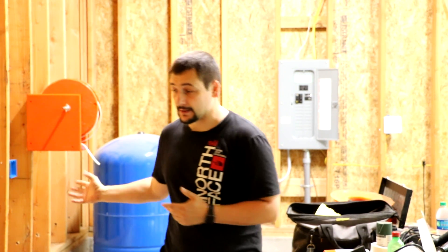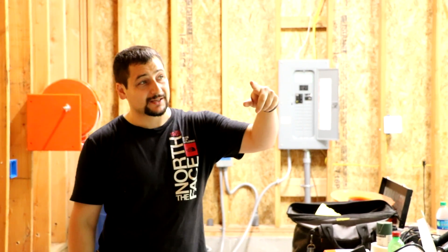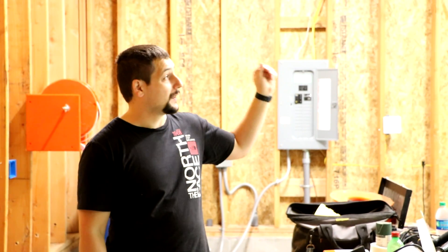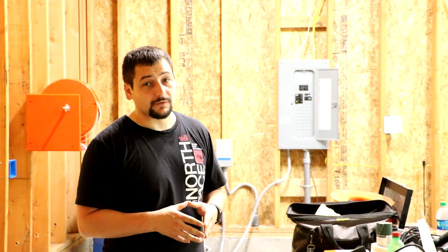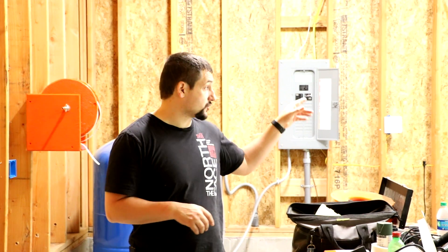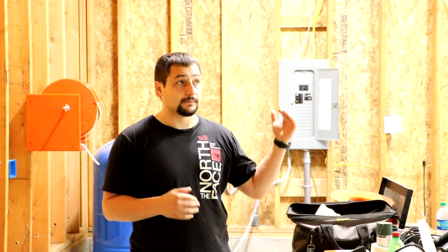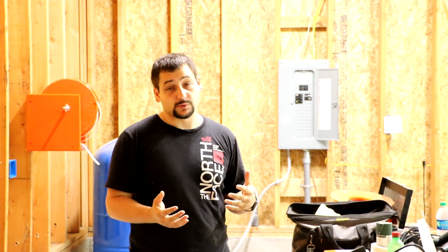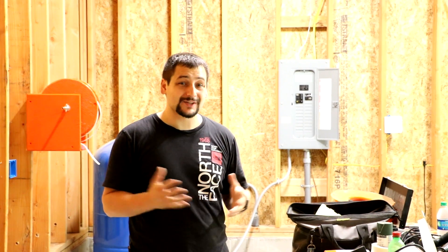So what I've started doing is installing some of the plug-ins, which I'll show you in a minute. I've got some of the blue boxes installed along the back wall and the side walls. I've installed the exterior decorative lights on the front of the garage. I have installed the plug-ins for the garage door openers, and I've also installed low voltage wiring for the sensors on the garage door and the garage door switch. I ran it inside of the studs, which garage door companies won't do for you.